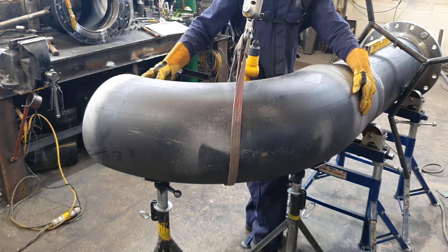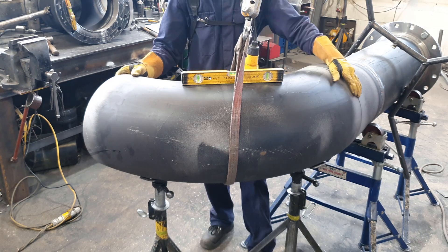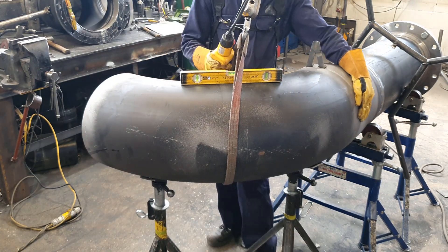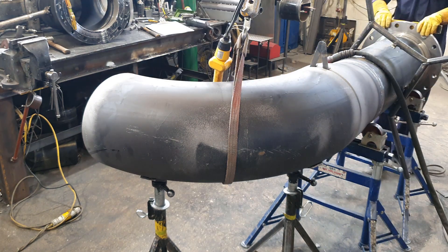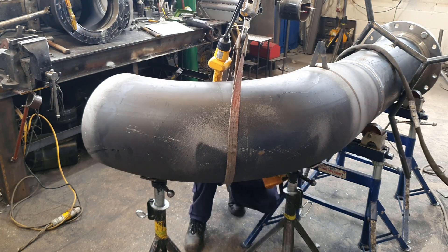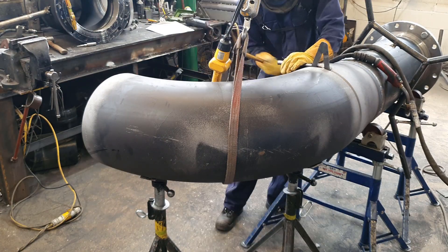You can see I'm going to skip through welding the elbow a lot faster. Here is a mistake I made: I've used my 3mm spacer, it's a little bit bent, and I've tacked the top and then the bottom and now I can't get it out — it's trapped in there and I can't reach a hammer to smack it through. So I had to sacrifice it. You live and learn.